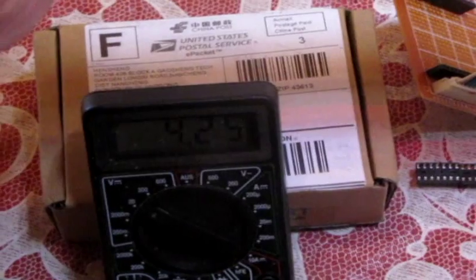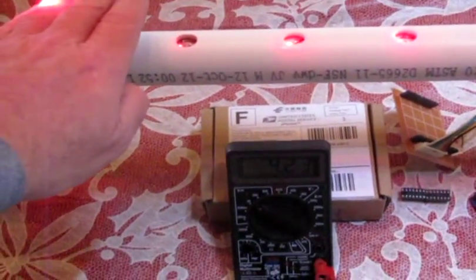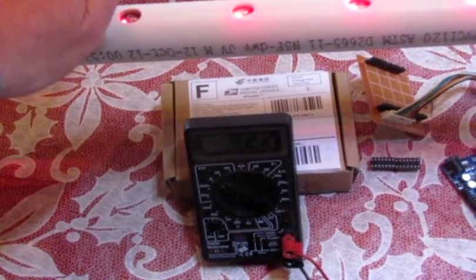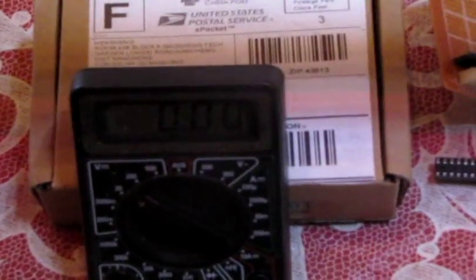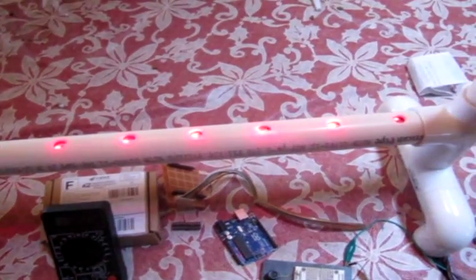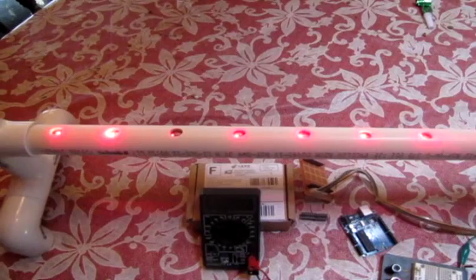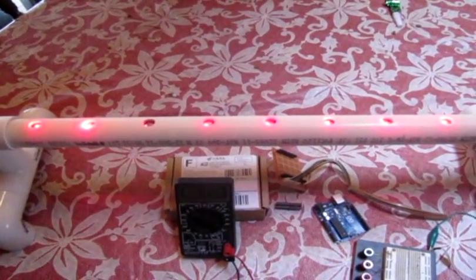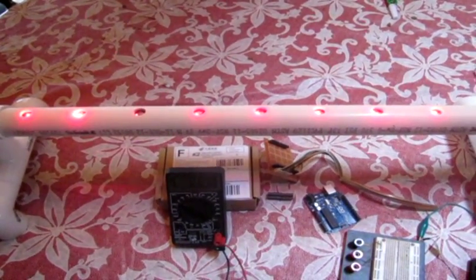But hopefully this will come out. If I cover up one of those, I get a high and that'll be an interrupt. What you're seeing is an interrupt signal — I can get a low. So if any one of those is interrupted, you get a high output. Each one of those will tie directly into a data input port on the Arduino. When the interrupt occurs, it'll read in all nine bits, and then we can play whatever tone or recorded output that we want.